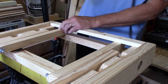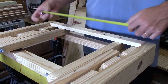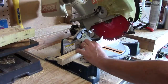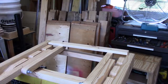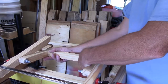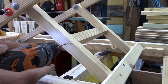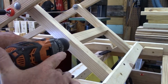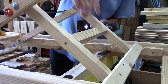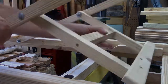So now I'm going to start putting some slats on. This is the all the way where your head goes up. I'm just making a support piece to go in between that, whatever you call that piece. I don't know, it's whatever that adjusting thing does, but it just helped strengthen it up from wiggling left and right with the carriage bolts at the top, because the carriage bolts aren't tight. They're just snugged up enough to allow it to move on its own.